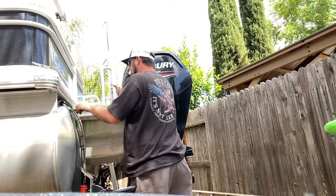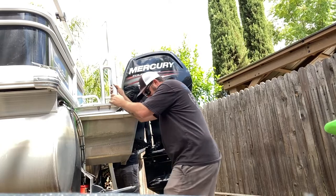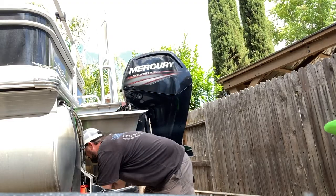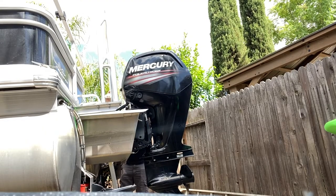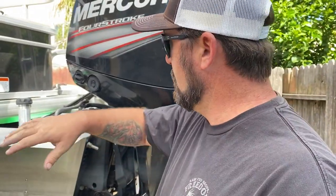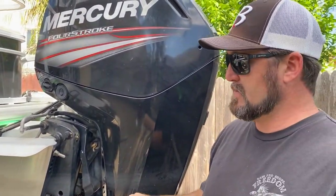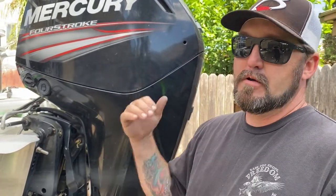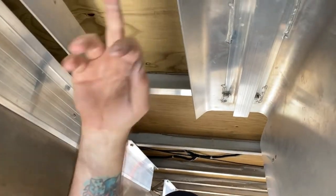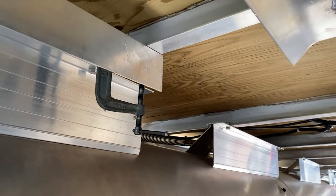Now I'm going to push it up. I'll climb in with my C-clamps and we're going to clamp it — you can just hold it from tipping. What I've done is put it up under here and tightened the ratchet strap up to kind of hold it right there. Then you crawl underneath, take two of your C-clamps, and clamp it to the Z-bar — those are the cross-deck supports underneath the pontoon. You want to put the end of the beam right on this Z-bar, which is basically as far as it can be pushed in. Clamp that there and do the same on the other side.